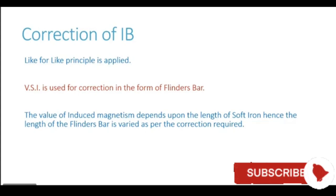So how can it be controlled or the magnitude changed? That can be done by changing the length of the soft iron which is used as a corrector. The longer the soft iron, the more induced magnetism it is going to attain. So if we require a greater correction, then we use a longer Flinders bar, and in case the correction required is minute, then we can shorten the length of the Flinders bar as per our requirement.